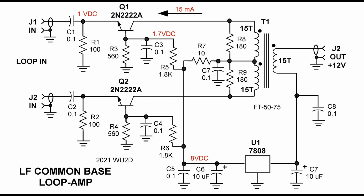The common base amplifier was popular for RF amplifiers in the old days when transistors had very low Fts. It doesn't suffer from the Miller capacitance limiting effect, and the upper 3 dB point is greatly extended. You don't see this circuit much used outside of RF applications very often, but actually it's a superior amplifier for things like moving coil and electret microphones. I use a common base amplifier on my electret amplifier in my ham station. The input resistance of a common base amplifier is governed by the thermal voltage of the transistor divided by the current through the emitter, which is approximately the collector current.